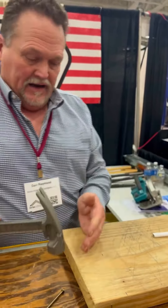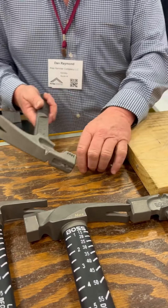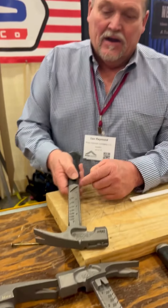We've got dual-side nail pullers in the top of the head, so depending on how you've got a hold of the handle, you can pull with it. We've got a hexagon-shaped face, which works ideal for nailing up against the wall with that flat, quick squaring a 90 off for checking, or setting a toenail into a wall with those ears right there. We've got a quick 45-degree cast line right there — bottom that out on the framing member and mark that, and that's a 45-degree line.